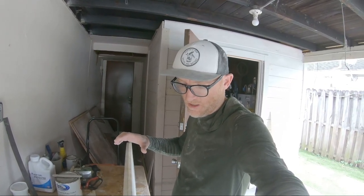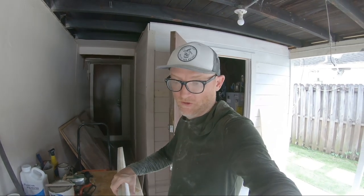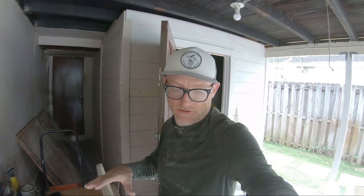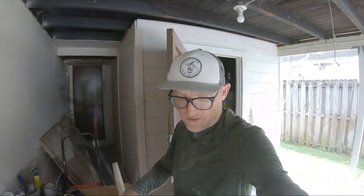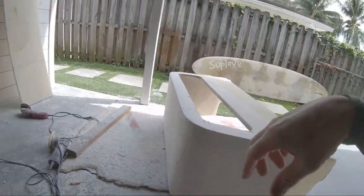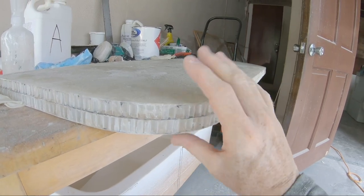I took extra care to make sure the panel stayed perfectly flat, because the heat of polyester resin when you lay biaxial on one side of Nidacore will warp it. I laid it on a very flat surface and put a strip of 1x3 wood over the top with a couple cans of paint to keep it down until it cured, then flipped it and did the same on the other side. This is a rough cutout to match the top of the box.